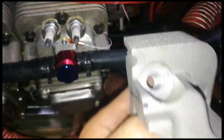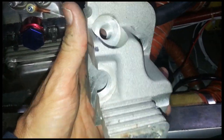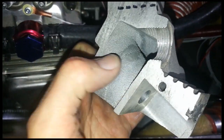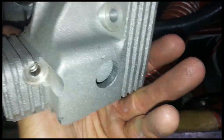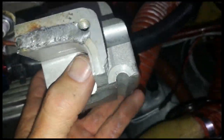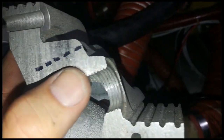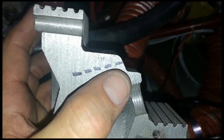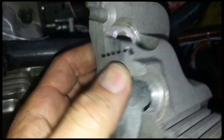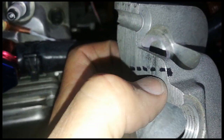And if you see on this scrap bit of cylinder head that I've hacksawed up, you can see that's pretty much where I've drilled it through, right through that area there. You can see where it would be sitting. That's the banjo bolt, that's the spark plug hole, and where my thumb is, that's part of the water jacket where the water runs through. And that's the Welsh plug on the side where the sand comes out. That's the water jacket all through there — this is just a quarter section of the head. You can see the material I'm drilling into where that dotted line is — that's the meat I've got to drill into for the probe, so there's no risk of touching the water jacket as long as I stay on the same parallel line to the inclination of the spark plugs. You're pretty safe to drill and tap there.